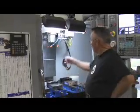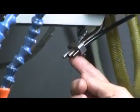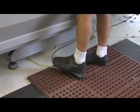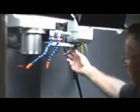We just finished up our little bracket here that holds all of our nozzles. The center nozzle is your P-Cool, which is programmable in height for each one of your particular tools. The one on the outside with the black hose has to do with your foot pedal — when you press on the foot pedal, any time you want to put air on the project to blow chips away or cool it, you can do that. The center one is for your coolant, and the one we just hooked up today, which is really nice, is your programmable air nozzle.